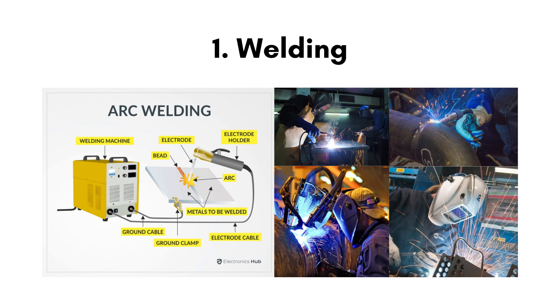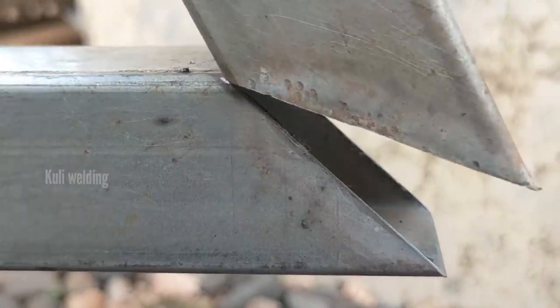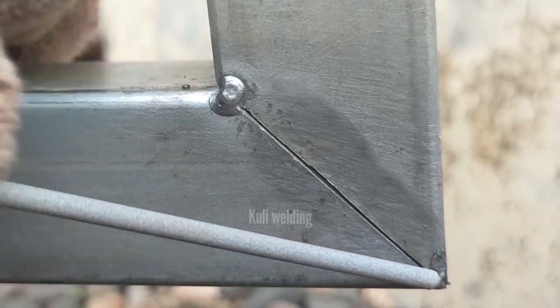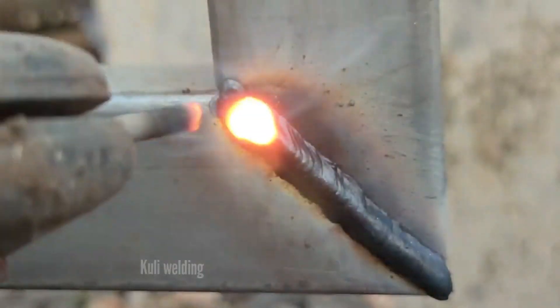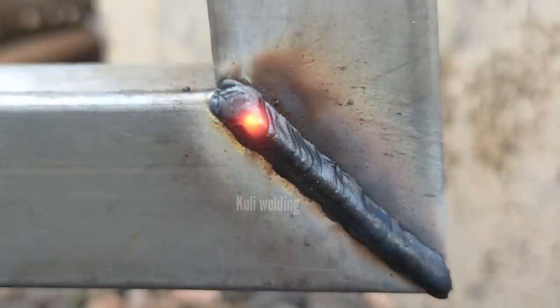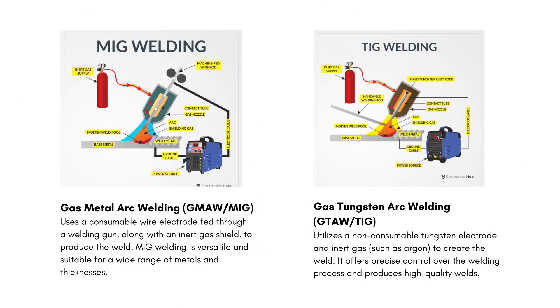Number 1: Welding. Welding is the process of joining metal or alloy parts together by melting an area and layering it on top of a second piece. There are several different types of welds, but they all come from one principle: joining two pieces together will make them stronger than if they were only brought together with adhesion alone. The four most popular types of welding techniques are gas metal arc welding, gas tungsten arc welding, shielded metal arc welding, and flux-cored arc welding.